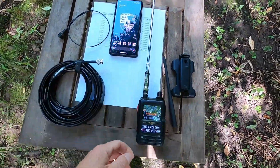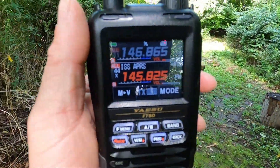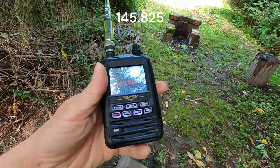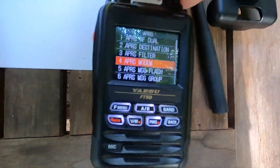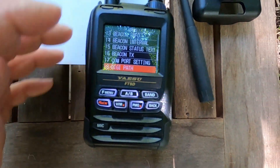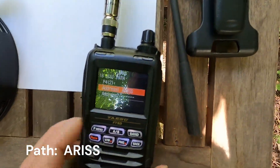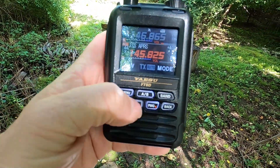So I've got things set up. First things first, I've got my antenna on my HT. I have this set to the ISS APRS frequency, which is 145.825 — that's the frequency that the ISS APRS functions on. You also need to get your path set correctly. So if I go into the APRS digi path settings, you need to have it set to A-R-I-S-S instead of your normal digi path. Once you have those things set, this will be ready to roll. I'm on the right frequency and I've got my path set correctly.